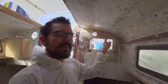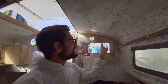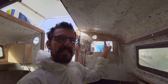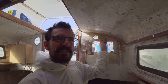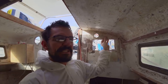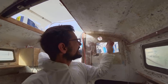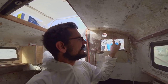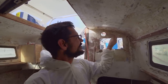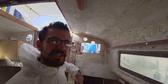At some point in the past there must have been a gauge here, and this has just been repaired by putting in a thickened epoxy plug — that's really common on boats. Usually what happens is just a plug is put in and then painted over, but they don't really do much unless they're glassed both sides. Just putting the plug in itself fills the gap but it's not particularly strong.